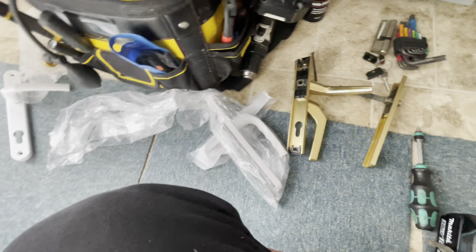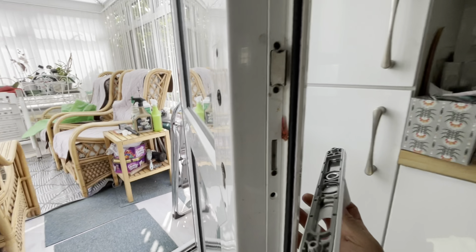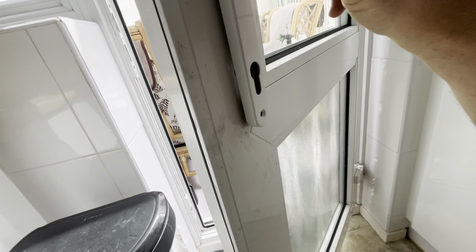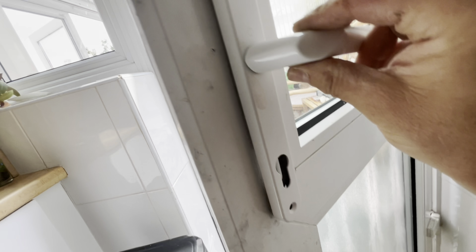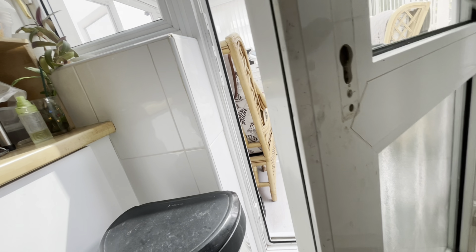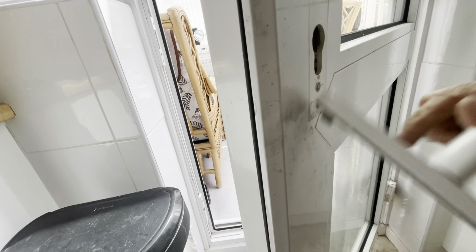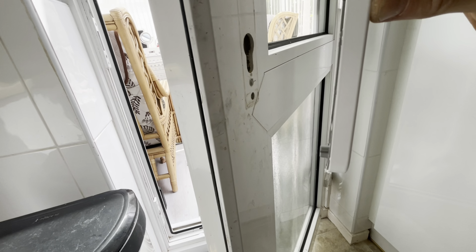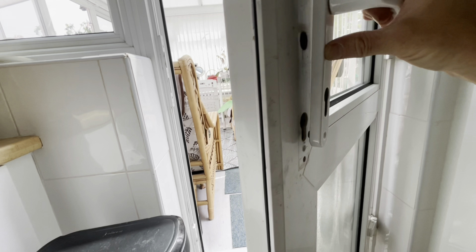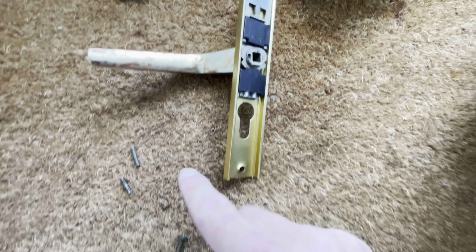These handles are discontinued in this size, so we're going to go for something a bit bigger like that. I've got the mechanism out just to check that the new screws are going to clear the gearbox. This one I just need to redrill holes just above there — I think the bottom one might line through but I need to make it bigger just for this little stumpy bit, and then hopefully these handles will work nicely.